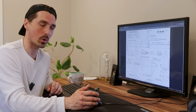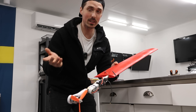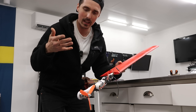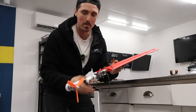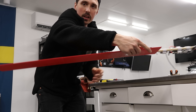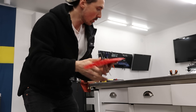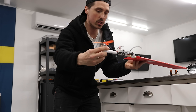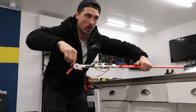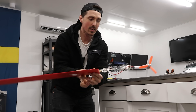So I guess that's what we're going to do as well. Sometimes you just miss the most obvious things. The motor was also facing the wrong way. When the motor is pulling forward and you rotate the wing, you can see the trailing edge of the wing is slicing through the air — and that's obviously not correct. So if we just rotate the motor 180 degrees, now you can see the leading edge of the wing is slicing through the air. That's correct.